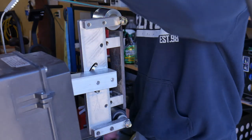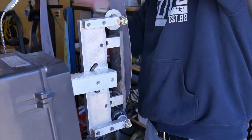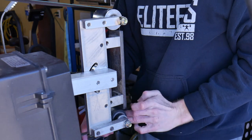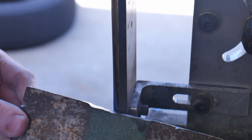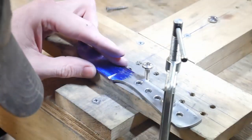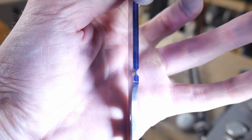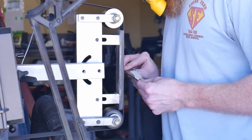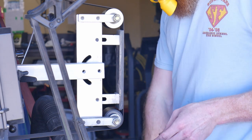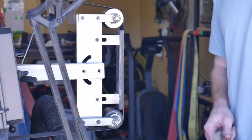For some additional tips and tricks: I have heard of one method of turning the belt around so that the same abrasives on one side of the belt grind the plunge lines on both sides of your knife. I have had mixed results with this, but sometimes it really fits the bill, especially when using Gator belts. It is also worth noting that when using new J-flex belts, use a piece of scrap steel to roll over the edge of that belt and prevent gouging on your plunge lines. Another method is filing in your plunge lines and then grinding away the excess. I had great success with this method early on — it let me get behind a grinder without worrying about plunge lines and gave me a good base starting spot. I would take it from the grinder back to the filing jig and clean everything up, and doing this enough times put me through the motions to get the grinding skills down.